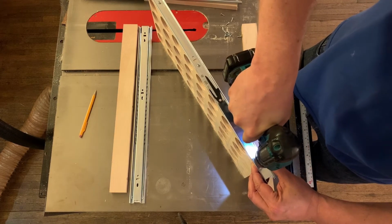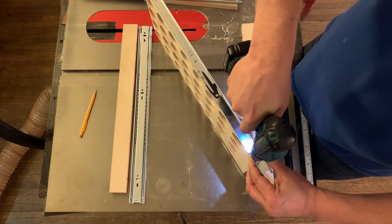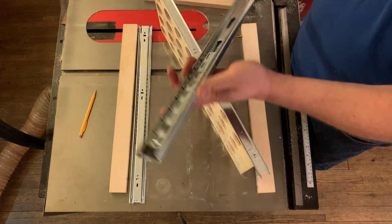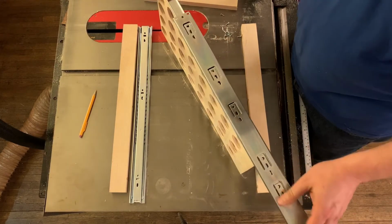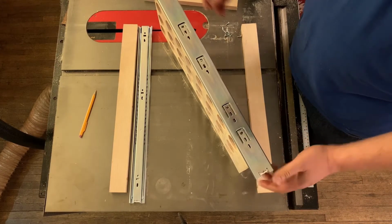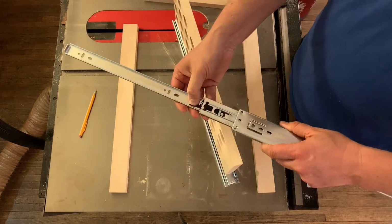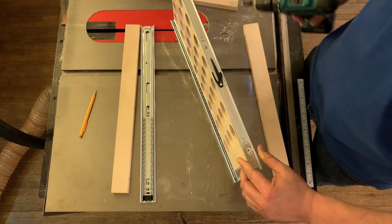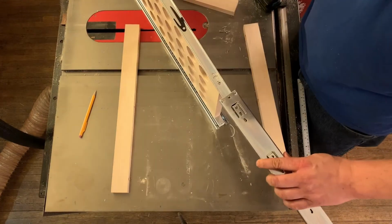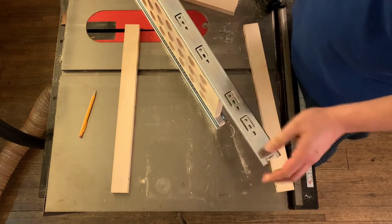If you're pushing too hard, you're doing it wrong. So you're going to use the screws that are provided, 3 per thing, and just get it attached to your drawer. Now you're going to put the other part of the glide on to see if you have a good fit. It should not have any resistance. If it does, that means something's way out of whack or warped and you're going to hate it. So then you do the other side and check it.